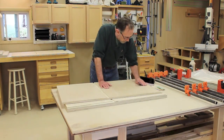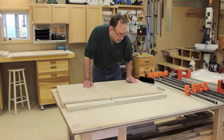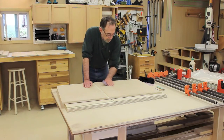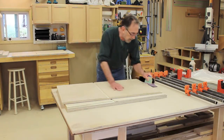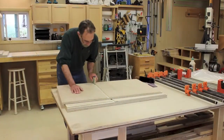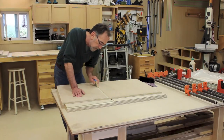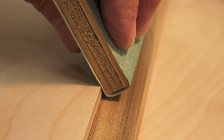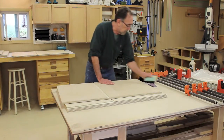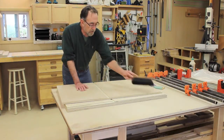I'm now just taking the other individual pieces and giving them a light sanding, removing any chalk or pencil marks I used to identify the parts or put layout marks on. I'm also using a little sanding block to make sure I don't have any little fuzzies on the sides of these dados, and putting an extremely light chamfer on the edges of the dados so that assembly — and if necessary, disassembly — is easier going forward. After I do each piece, I'm careful to remove the dust so that doesn't interfere with my glue-up.